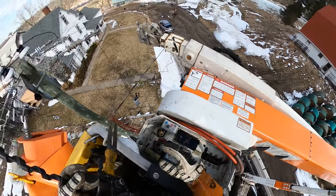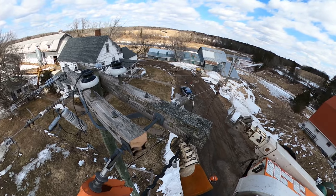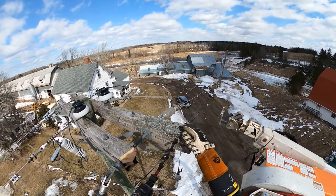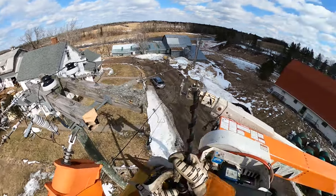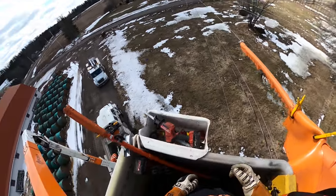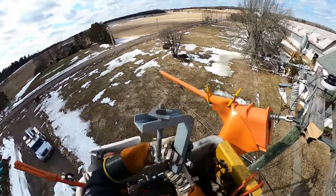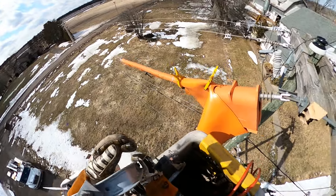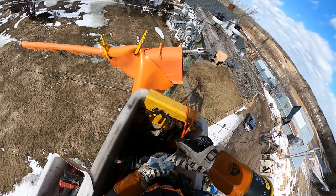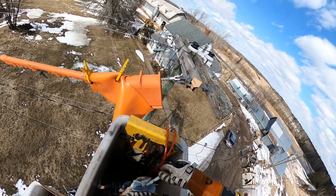This is something we don't use much anymore — our hydraulic impact gun. We've got a Milwaukee bit in it, but we actually use the Milwaukee battery drills for pretty well everything now, so you're not fighting with hoses tangled up in the bucket. Here's our cutout with an extended bracket to kick it out past that cross arm, which would be considered ground. You don't want the live part of that cutout too close to ground or to anything of a different potential.